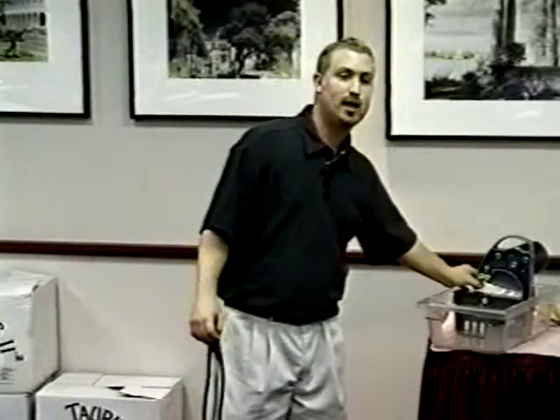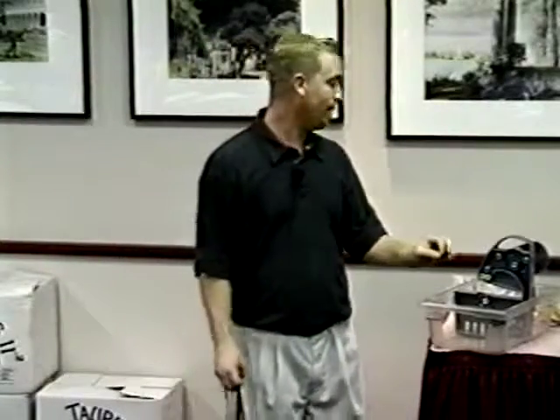When it's time to replace the belt, two things will happen. First, you're going to be cutting on your saw and the blade's going to stall a little bit — it might stop. You can hear the saw running but the blade stops. Or it's going to do that in-and-out movement. Your belt is starting to wear out. So you take it off and take a look at the groove.